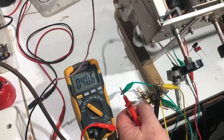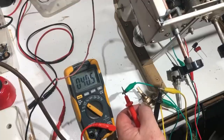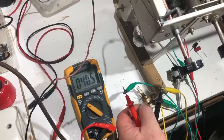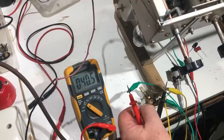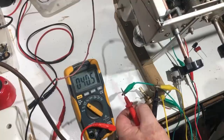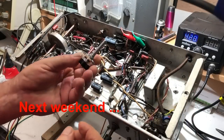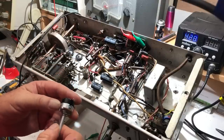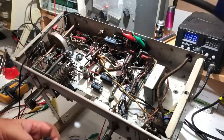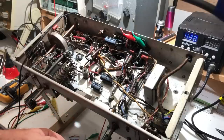I've also checked that with the pot at zero it sounds exactly the same as with maximum treble cut in with the switch. I think what I need is a 50k pot, preferably one with a switch. My potentiometers have arrived. I couldn't get a 30k or even a 50k switch pot, so I've got a 500k one and I'm going to put the switch on the volume control rather than on the tone. I was able to get a 50k pot for the tone — I might put a resistor in parallel to cut it down to about 30k.